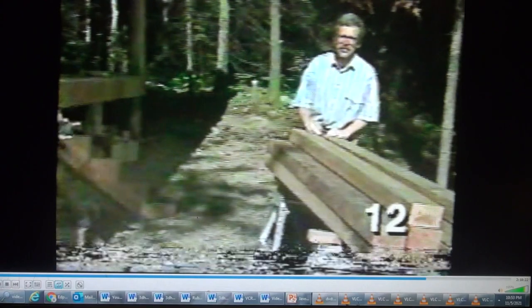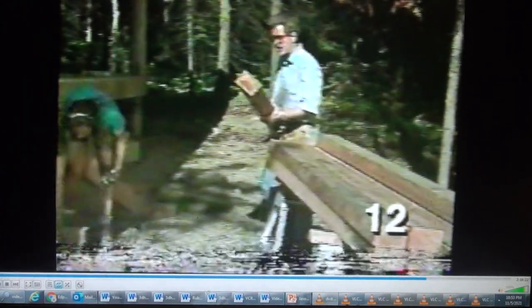We're using the same techniques and materials here on our back porch stairs that we used on our front. Now, each of these jacks is a pair of 2x12 redwoods that have been screwed together and then cut to a rise of 7.5 inches and a run of 10 inches. Now, the tread should be strong enough. We're using a pair of 4x6 redwood spaced about 1/8 of an inch apart, and we'll be securing these to the jacks using 6-inch galvanized screws.